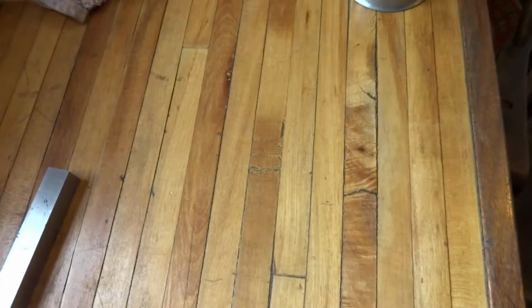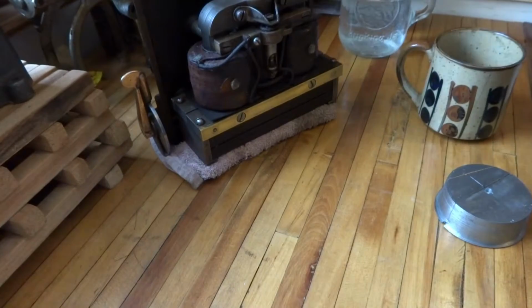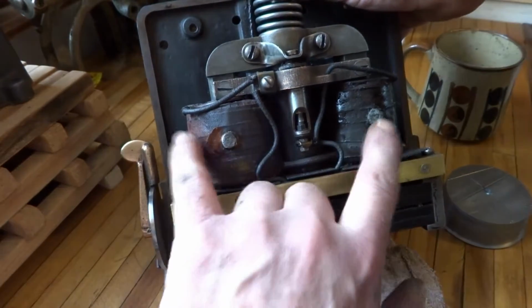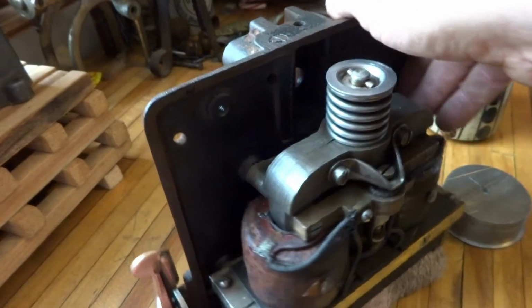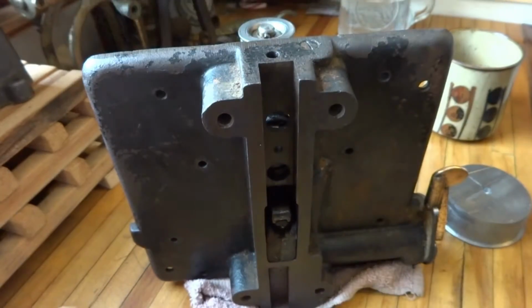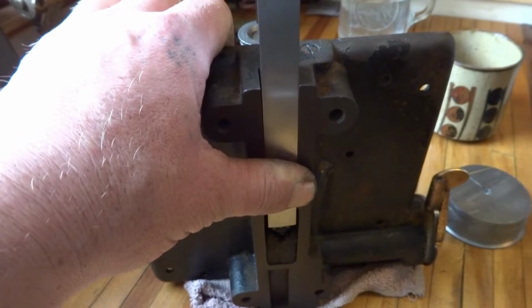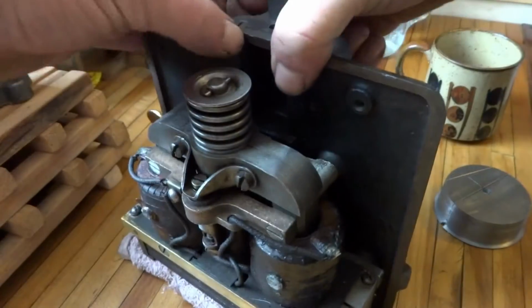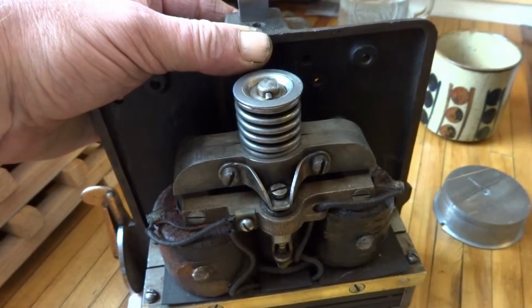But what this guy drives over here, if I can move the camera around a bit. This is the inside of the magneto. Your magnets down here, your coils, like a little breaker point there. And around the back, here's a piece of bar stock I started finishing. It just nudges. That's it. Bang. And that makes the spark. Just a tiny bit of motion. Kind of amazing how many volts it generates to jump a nice big spark. And that's it. Interesting motion.